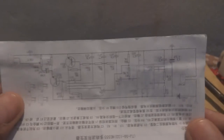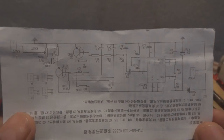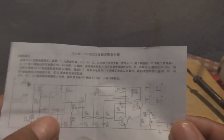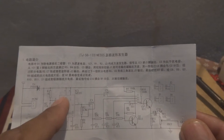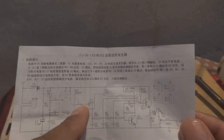Here is the schematic diagram. Of course, you can download this schematic diagram from my blog. The blog link is given below in the description, so you must see that blog. There you will get this diagram. It is written in Chinese, but we can make a little bit of understanding. The power is coming from here, then the 555 IC, and these two terminals, 4 and 8, are the power terminals, and 3 is the output.